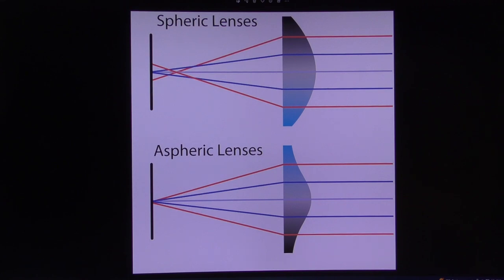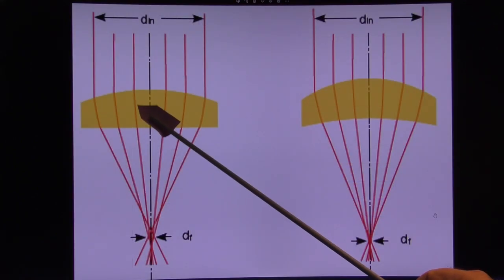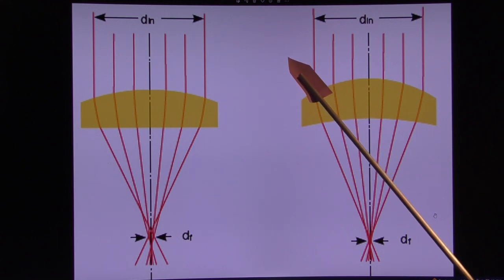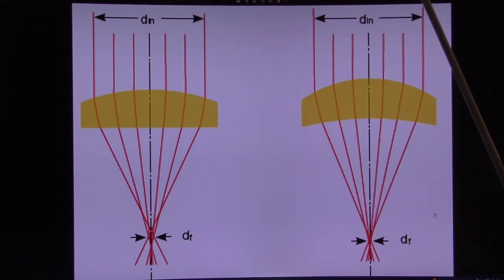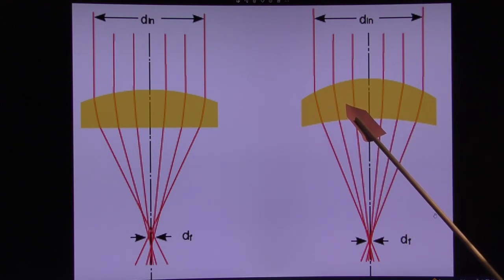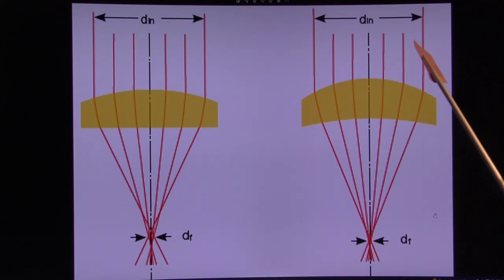I happen to know that that's not such a brilliant idea because I've been doing a lot of work with lenses and laser beams. The CO2 laser lens is this yellow material called zinc selenide. Down at 450 nanometers, you can use probably just ordinary glass of some sort, a specialised glass. Now, this is a much cheaper lens to manufacture than an aspheric lens. That's why I don't think that they would use an aspheric lens in a diode laser.